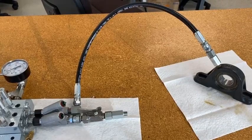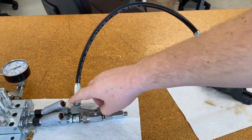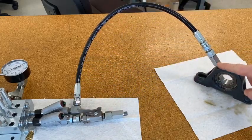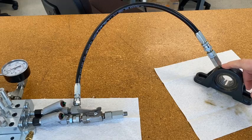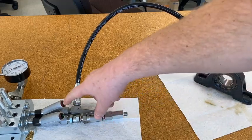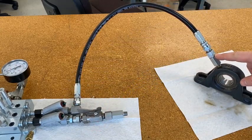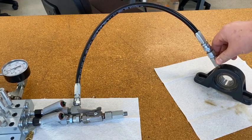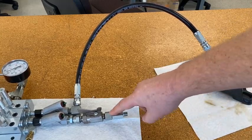Sliding over here, we have our indicators with the green pins extended to show that they're already pressurized. This is the hose that connects to the simulator, and this is more like what you're going to do in real life where your simulator is right at your bearing point. That's important because the BLI can only monitor whatever is between the indicator itself and the simulator. So if you put this in-line somewhere, anything down-line of the simulator isn't getting monitored. It's important that this goes right at the bearing point.